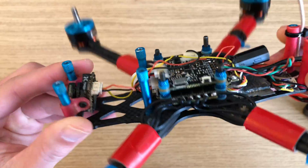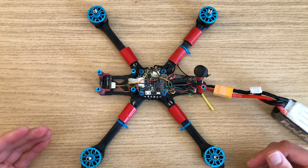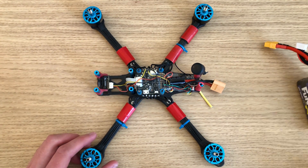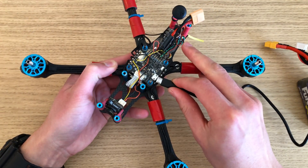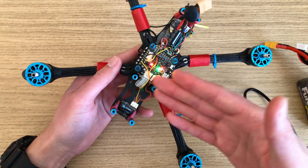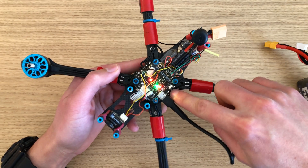Honestly, I am not seeing anything right now. Another thing I've noticed is that when we plug it in, there's no lights on the flight controller. So the next thing I want to check is actually powering the flight controller separately to see if it works. I've got my USB cable here and we're going to plug that in. We do get lights. So somewhere along the line, the flight controller is not getting power, and the way it gets power on this build is through the ESC.